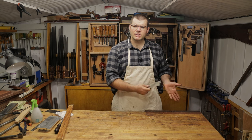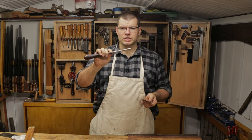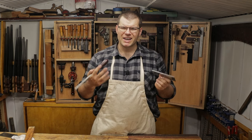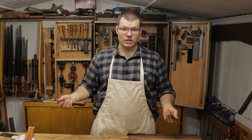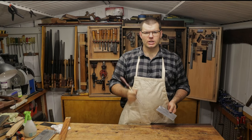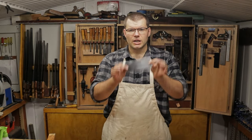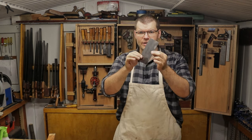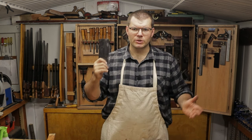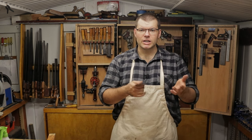It's pretty easy to take small shavings with a piece of metal with a hook turned on the end and it's not too difficult to do. When it comes to burnishers, I find it's better to get a proper burnisher. Some people say you can use old screwdrivers or spanners, but you don't know how hard that steel is — I've tried it with screwdrivers and it didn't work. Stick to the proper burnisher so you don't have any issues turning the hook. One last thing: because you have a rectangle, you can sharpen both sides of your card scraper and have a cutting hook on all four corners, so you'll go quite a long time before needing to resharpen. If it's not taking a shaving properly, just move to the next hook.